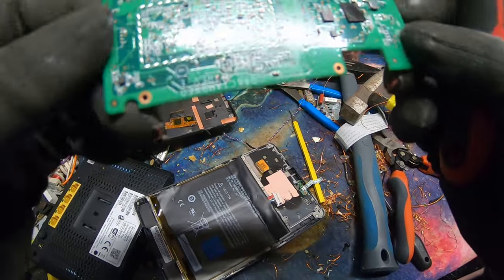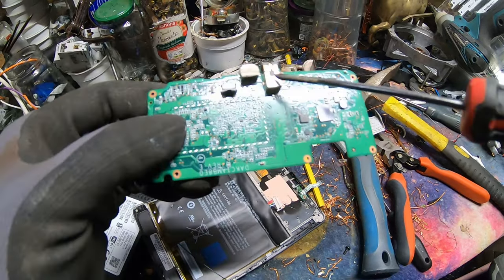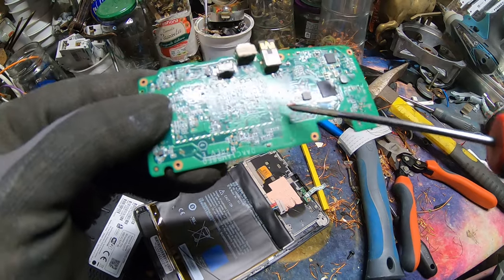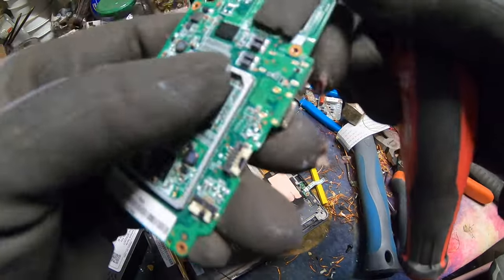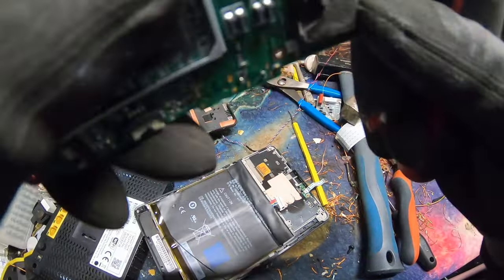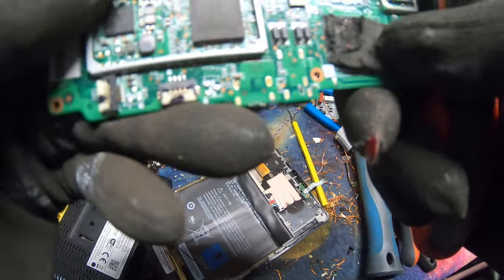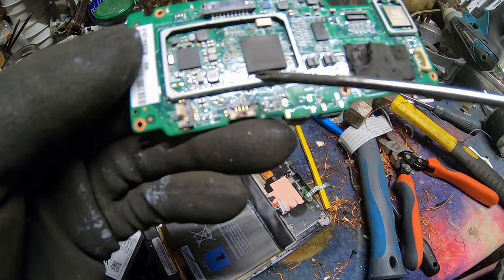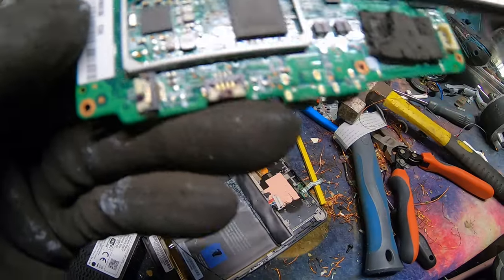Right, here we go. Here's the tiny board. Got some more gold plating here for this port for the jack there. Nothing special on the back here. Teeny MLCCs. Tiny little flat pack. But on this side, that's stuck on there, that's annoying. Is that an IC or a BGA or what? I'm not sure. I have to pull that off. But here you've got a gold band crystal oscillator. Some BGAs here. That's actually another tiny, tiny gold band crystal oscillator there. Woohoo!